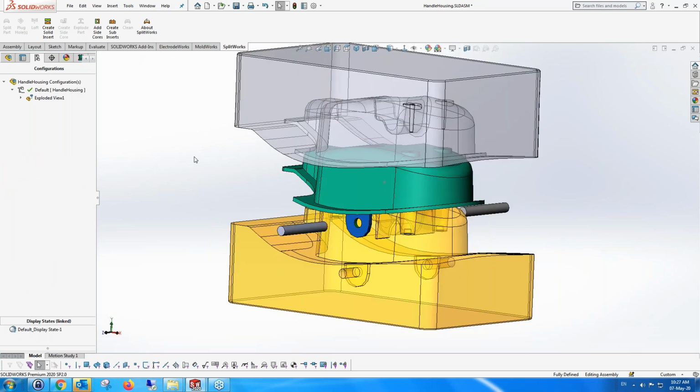We have another function here for those of you in the mold industry, and I suppose most of you are. The important function is sub-inserts. Often with the mold, you have areas which are more delicate, smaller, with all sorts of things which are delicate and which during the mold cycle process might be worn down by the actual creation of the parts. And you would like to be able to swap out and swap in a new part without having to actually create the insert again. So that's a very important function which is often used.